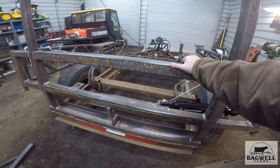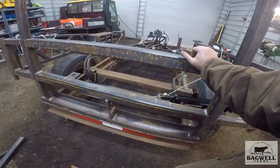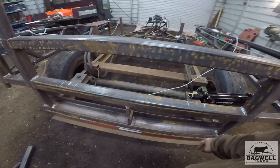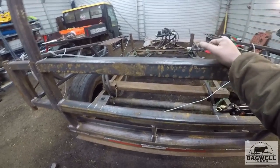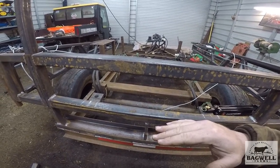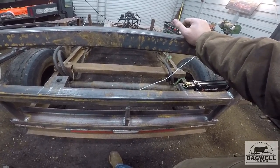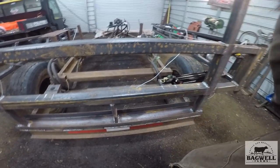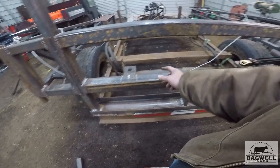Back here the only thing I've got left to do for mounting nozzles is get a piece of inch-and-a-quarter the length of this, come off just a little bit, and weld it on. Now this frame - what we're going to be starting today - I've got to go get the steel. I've got to partially redo this frame. The problem I've run into is there's a cylinder for the center, a three-and-a-half by eight cylinder. The problem is it's too high - I want more ability to get lower and still have enough movement to reach the height I want.